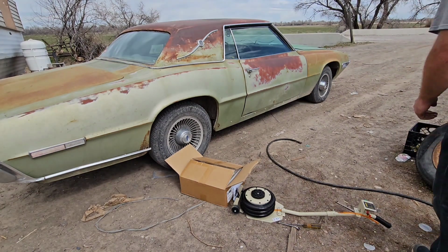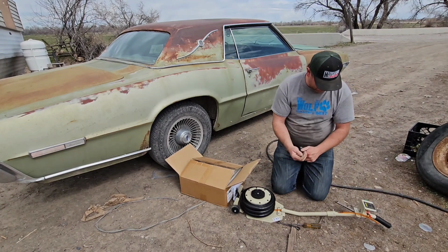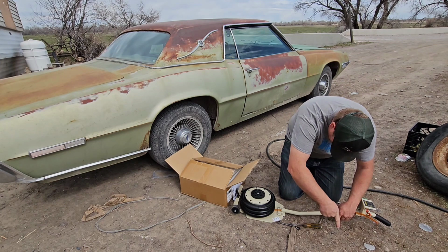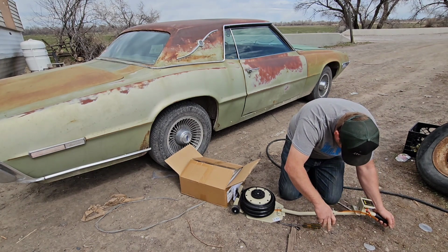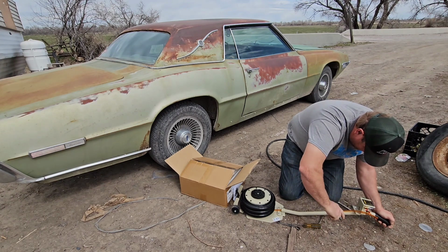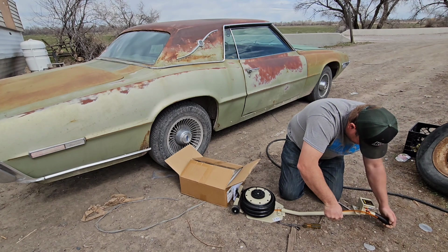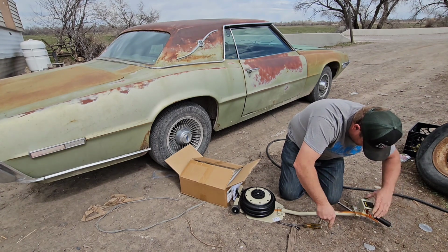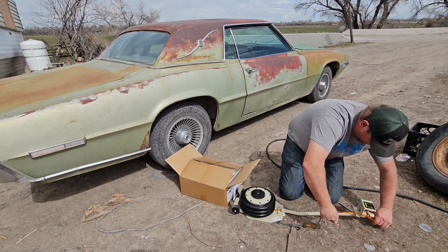Okay, so the Allen that we're going to need for this Vevor jack is a 5 mm. So we'll put these two in here. Get that pretty well centered. And we'll run our 5 mm in there to hold the handle where we want it. Yeah. Hard to center it when you don't have the air stuff already hooked up.